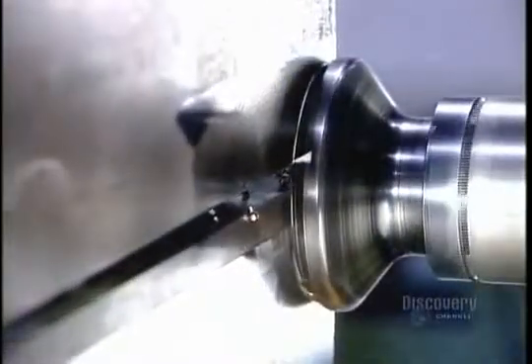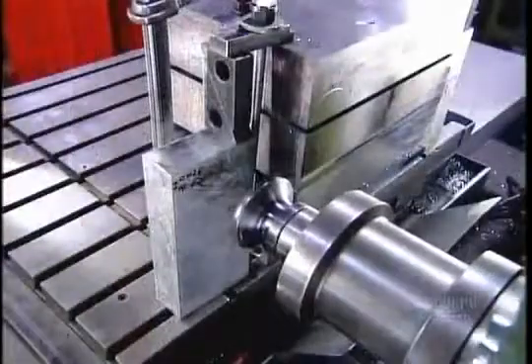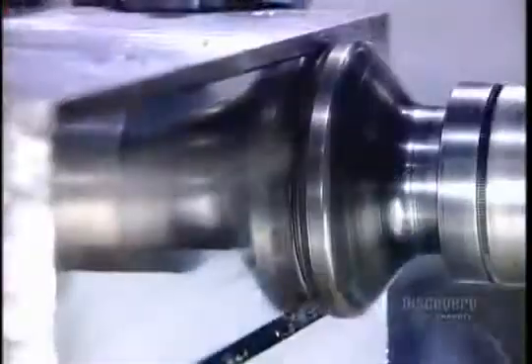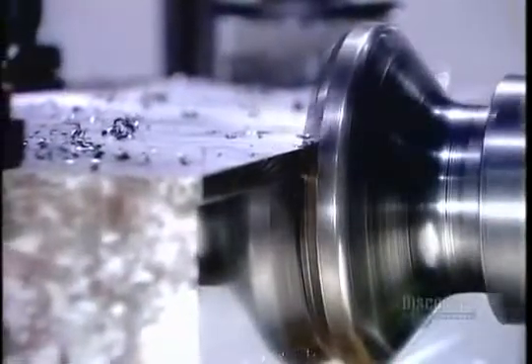They mount this base on a milling machine, which shaves the bars to the right dimension. This step is critical, enabling them to later machine the base into a mold that's faithful to the technical design, right down to the hundredth of a millimeter.